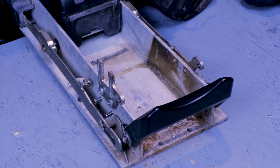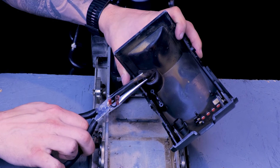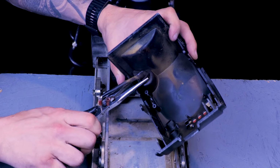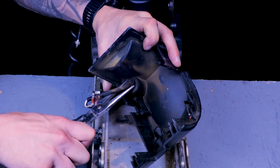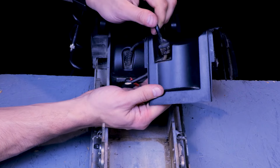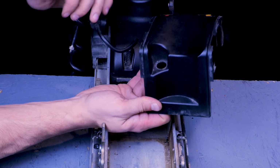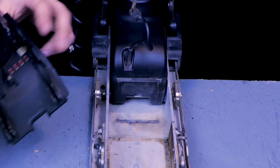Next, you can remove the steering motor wires from the control housing cover. You'll have to squeeze the tabs on the strain relief with a pair of pliers and slide it out of the hole. You'll only have to do this part if you are replacing the board on a legacy model like we're doing here. If you already have a Bluetooth model, this step isn't required.